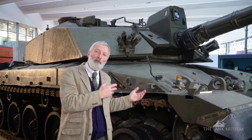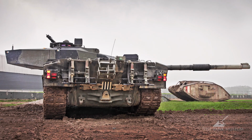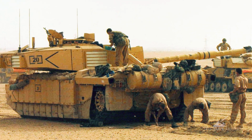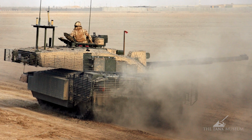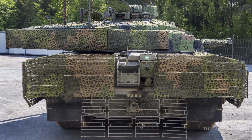In terms of weight, the overall vehicle here is just over 60 tonnes. When they add all the extra armour on, what we would call theatre entry standard, so they put the side armour on and the extra armour on the front, the bridging weight then goes up. They actually classify it as an 80-tonne bridging weight on this particular vehicle. So it becomes a much different vehicle.